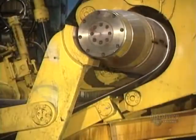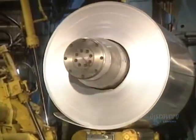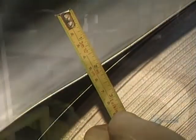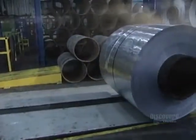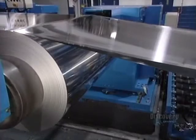The ingot has now become a 5 millimeter thick sheet. It is sufficiently thin to proceed to spooling, where it spools onto itself before being sent to the cold rolling mill, where its thickness will be reduced still further. The aluminum sheet has become very thin now and risks being broken by the tension needed for cold rolling, so the sheet is doubled to avoid this breakage.